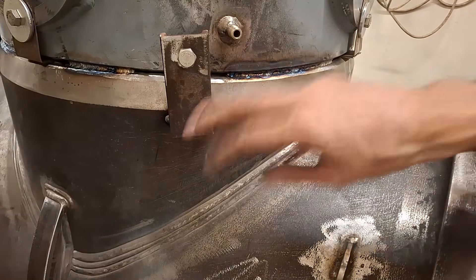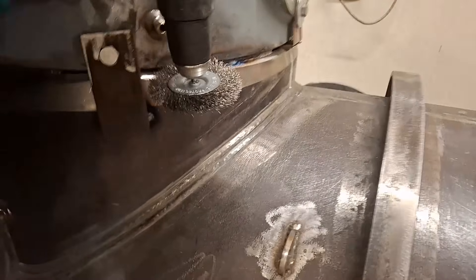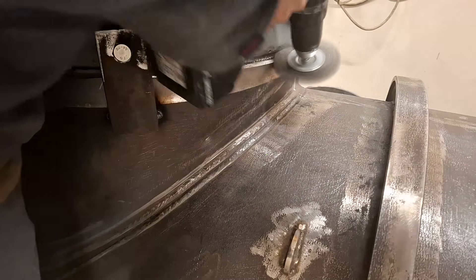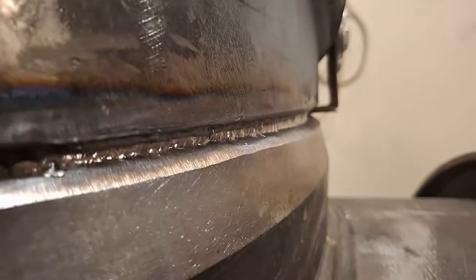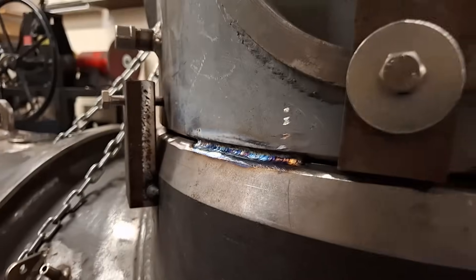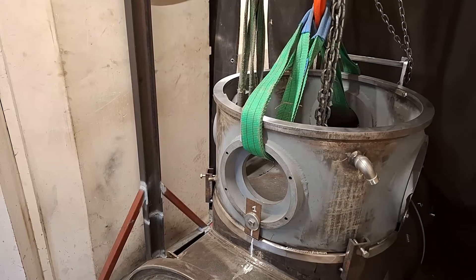You can see I'm having to stop here at these bits, but that's fine — I'll take all these off now. I'm seeing the fusion into the root there. Not all the way around yet, but definitely getting there. I'm just going to take these off now.